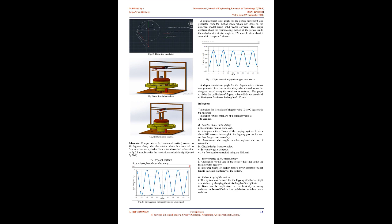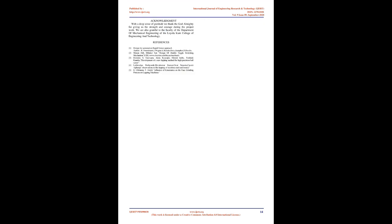Components Required for the System — Assemblies: (1) Fixture (Fig. 6): designed to fix the suction flange cover assembly in a proper position; other assemblies such as pneumatic cylinder and toggle switches are fixed to the fixture using sub-assemblies such as movable flange, fixed flange, and I-shaped structure. (2) Double Acting Pneumatic Cylinder (Fig. 7): provides an oscillating mechanism to the flapper valve by repeated forward and return stroke of the piston. (3) Filter Lubricator Regulator (FRL) Unit (Fig. 8): air from the compressor unit passes through the FRL unit, which splits the air between the two ports of the double-acting cylinder.